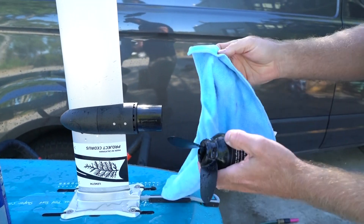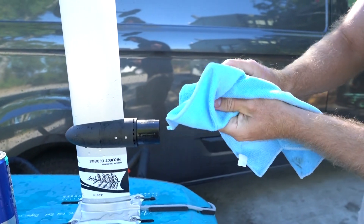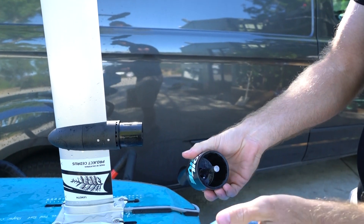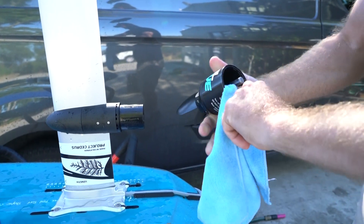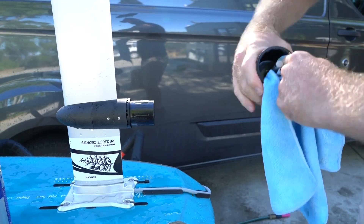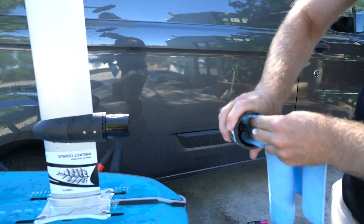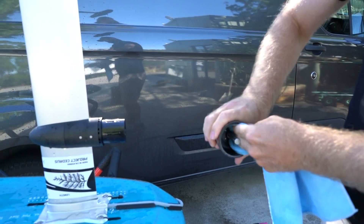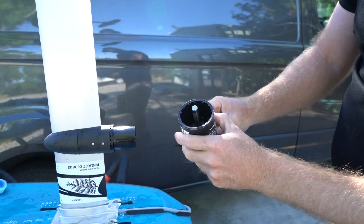Same for the rotor — you want to dry the outside quickly, dry the blades. The inside is the most important part: get the rag in there and go around to get the water out from where the magnets are. So now it's nice and dry.